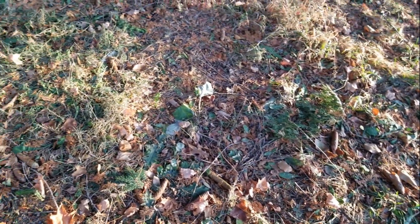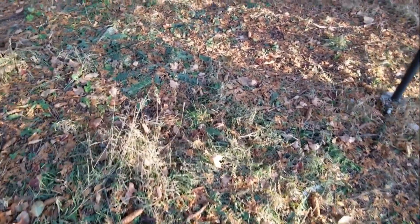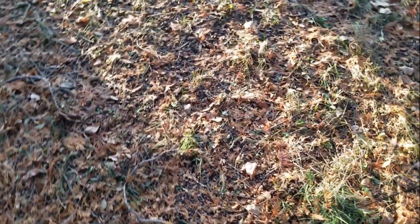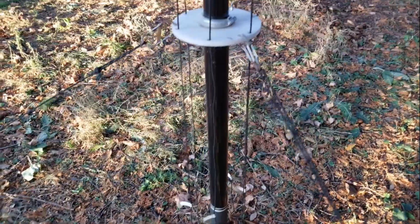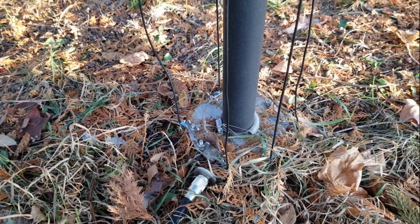Before I came out here to do the update, I did a real quick inspection myself and realized that in the last year, I didn't have one part of the ground radials hooked up, so that wasn't very good. If you're looking for the ground radials down here in this area, good luck, because they hide pretty well — nature takes over like it always does. One of the things I had to do was tighten up one of these guy wires — it's cord, not wire. So: attach the missing radials and tighten up the guy wire.